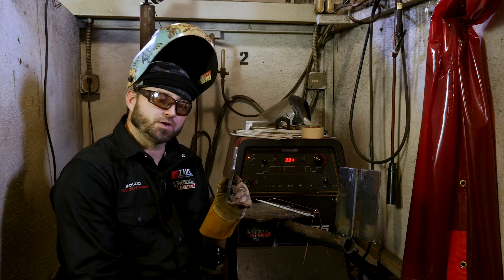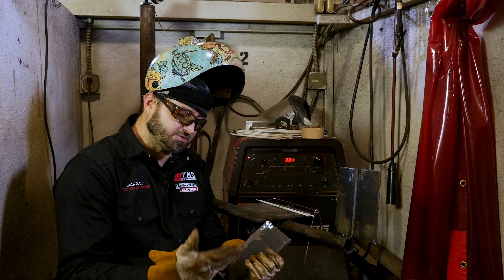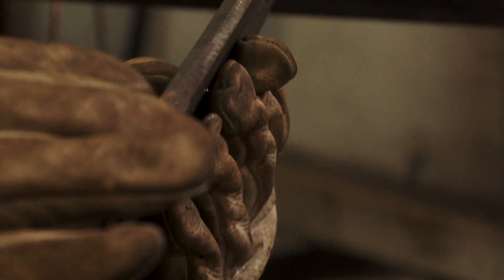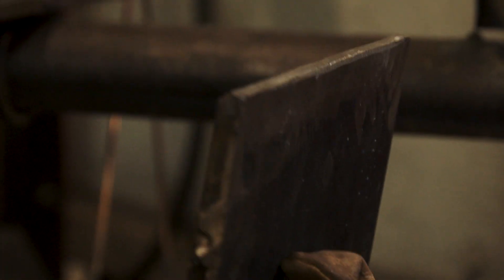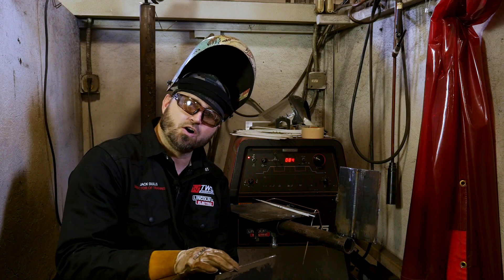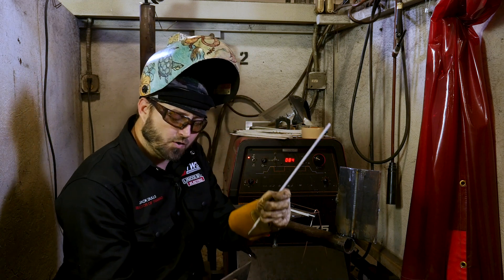First, what you want to do is get your plate and clean it up on the front side and on the back side, about a half inch back or so. You've got your bevel that's already been cut, and now you've got to put land on. Land is a flat part right on the bevel — your bevel comes to a knife edge. What I've done is laid it flat, tacked it down, and then took my grinder and went across it nice and smooth, back and forth, nice and consistent. What you're looking for is a one-eighth land all the way down — as wide as a one-eighth rod.